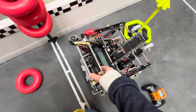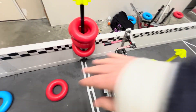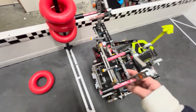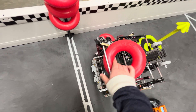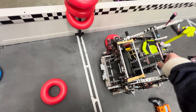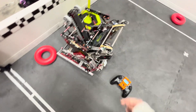The reason we're switching to Lady Brown for Worlds is that this wall stake mech was purely for wall stakes. You couldn't do what a regular 360 Lady Brown can do — tip over goals, or score an alliance stake the way a 360 Lady Brown works. In autonomous we put our preload in here and tilt it up, which was actually really consistent. But it's just a lot more limiting in terms of overall design.